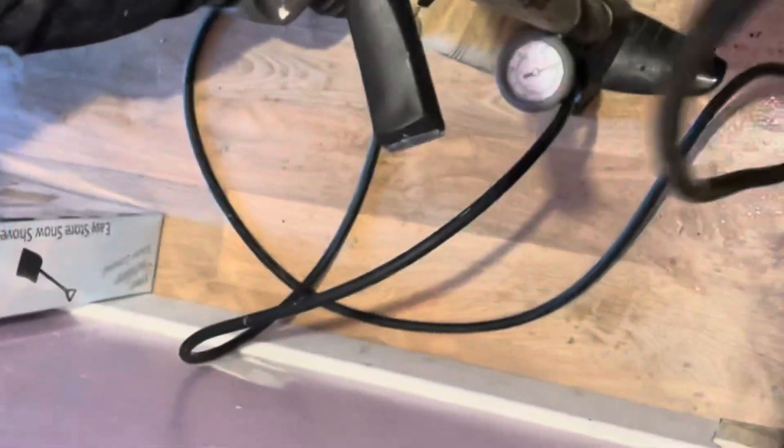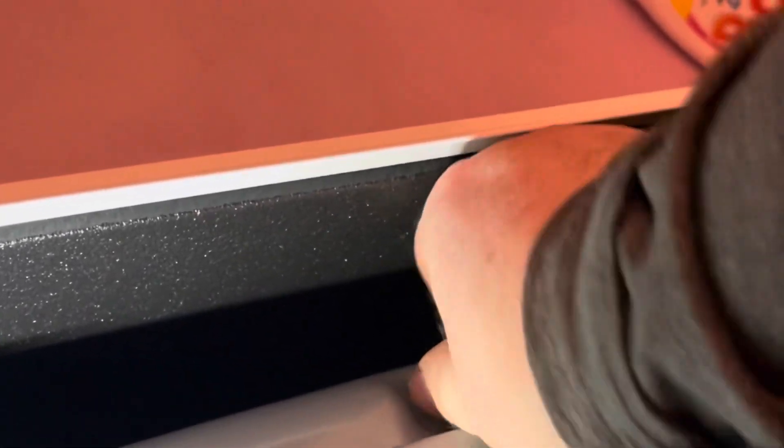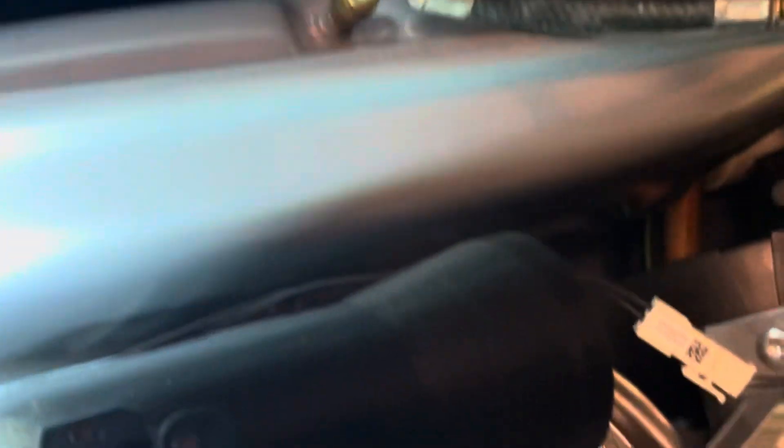It just needs recharged. We're back at the expansion vessel. We've got our foot pump and the vessel just down here. What we're going to do is drain all the water out of the vessel first, and I'll show you why we need to pump the water out. Mark's going to pump it up to one bar — don't pump yet until I get outside, and hopefully I'll see the water pumping out.